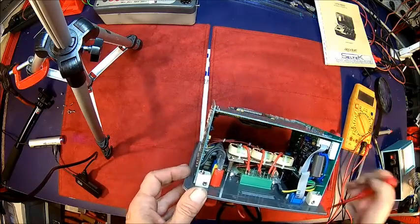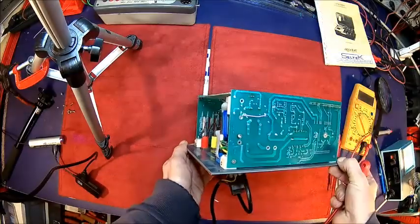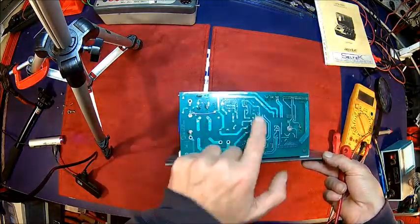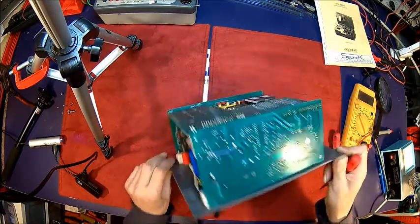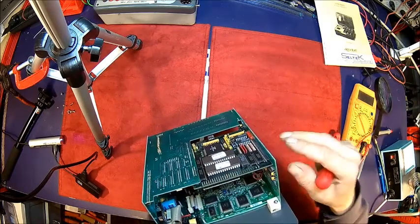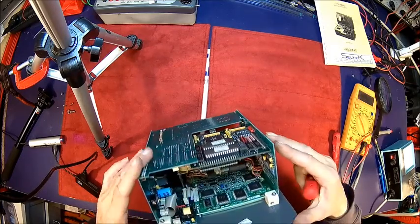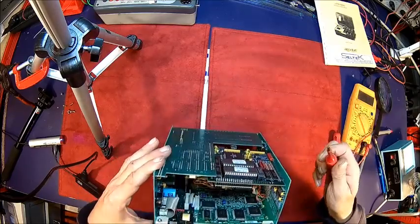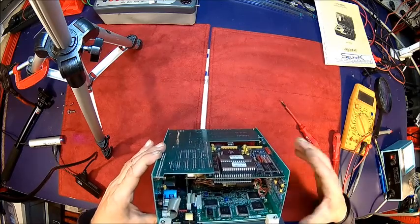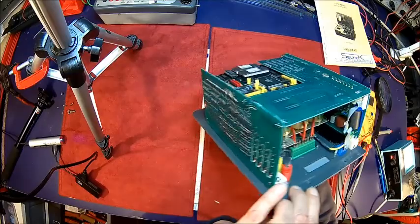Power comes in here, so this is the power supply here. The electrolytic has not exploded. Apparently there's no writing on the board, so we need to figure out what's going on here. Yeah, this is dangerous because that's mains voltage here. So we need to look what we can do here. It's got some memory here. Well, it's an interesting design. It's all a bit, it's not square actually. That's upright. Anyway, checking for loose components, then we'll check the voltage on the gold cap, and yeah, we just gotta be careful because it's all mains voltage here.